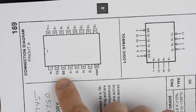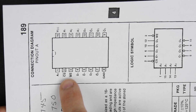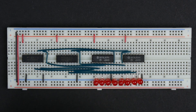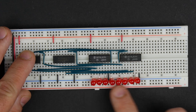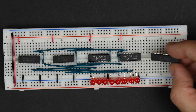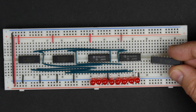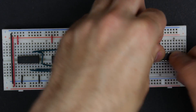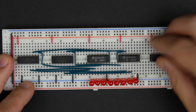If I look at the pinout of the RAM chip, pin 2 is chip select and it's active low. That allows us to enable or disable each chip, and in our case we always want them enabled. So I'm going to tie pin 2 on both chips low so they will always be enabled. To control whether the output of these chips is actually going out on the bus, I'm going to use the 74LS245 that we've used many times before in our registers — an 8-bit tri-state buffer. We'll add this in over here. It's a 20-pin chip, so pin 10 is ground and pin 20 is 5-volt power.